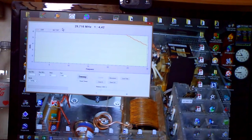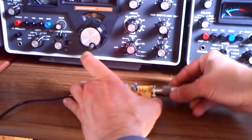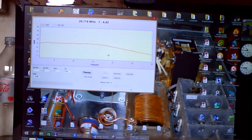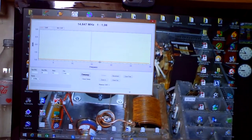You can see it's over 6 at the moment — no antenna on. Now I connect a dummy load and check it again, and here: low SWR. So it works nicely. Now we can check an antenna.